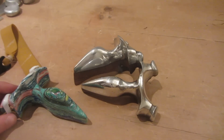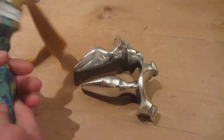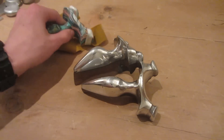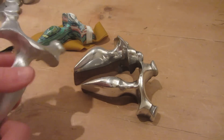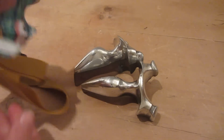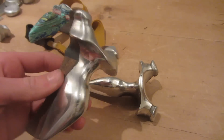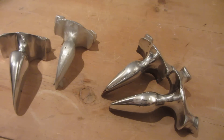You're also going to need a previous slingshot that you've made or bought that's really comfortable and you enjoy using. I like this slingshot so I basically wanted to replicate it in aluminium easily without having to make green sand. I'm going to show you how to press a simple slingshot into wet sand and cast half of it at a time. This is definitely not the most accurate method and you'll probably get around a 75% success ratio, so 25% will not work.